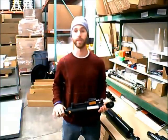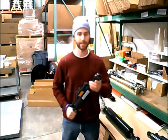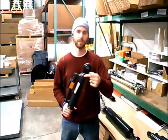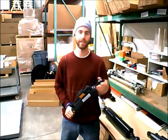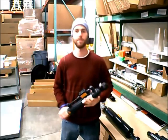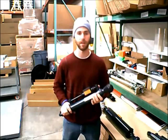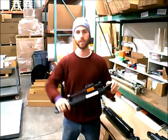Now we're going to cover the different types of ends we have on our top links. This is the category one and it's got two ball ends — welded-on ball ends on both sides. It's a standard end; a lot of top links come with them. If you have a mechanical top link already, it probably has the welded-on ball end, and it gives you a little bit of motion as the ball turns.